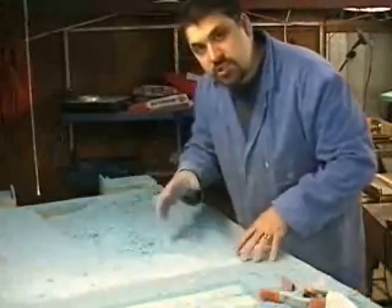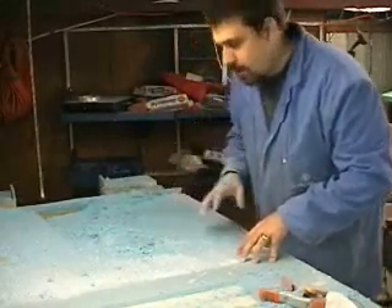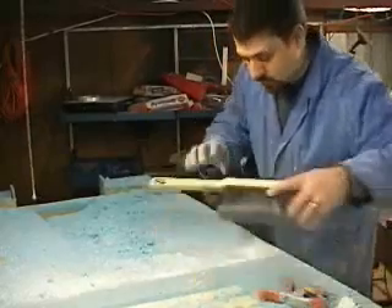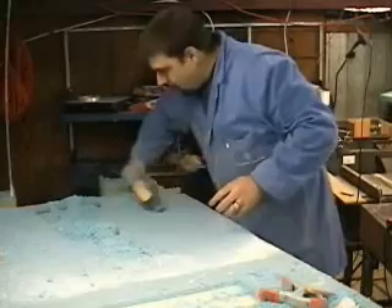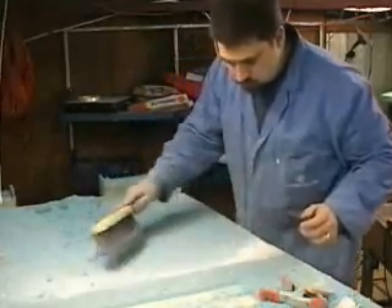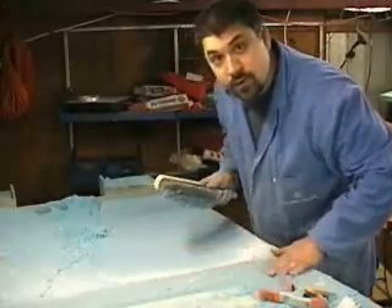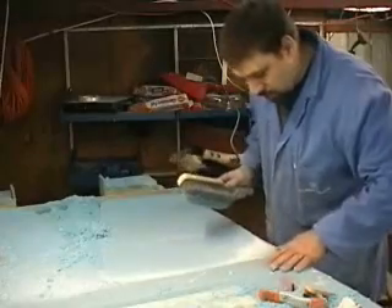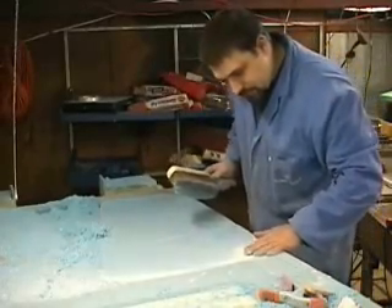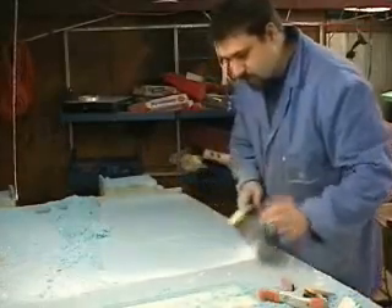You're going to have this much foam whether you've sanded it off or routed it off. So let's get rid of this and see what we look like. Perfect transition through the micro. If you see all this white over here in this corner, that is a very fine feathering of micro from PVC, micro, and then onto the urethane foam.